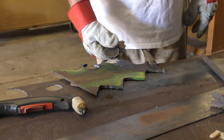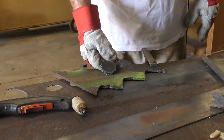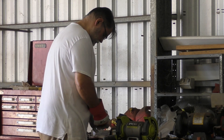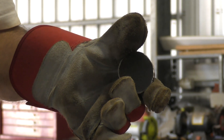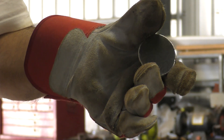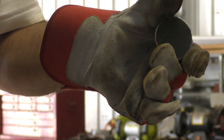There you go — just a bit of scrap cut into a rough circle. I'll tidy the edges up, get the dross off, and weld it to the top of that tube so I've got a proper striking face and the tube won't collapse or deform so easily. I've cleaned it up and I'll weld it on top of that post, and I'm pretty sure that will allow me to drive that bottom bearing out. Then I'll be able to move on to welding up the rudder post and getting it in the right spot.